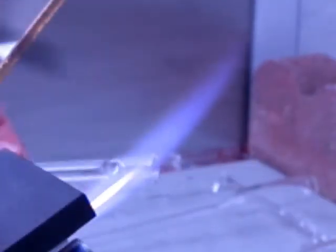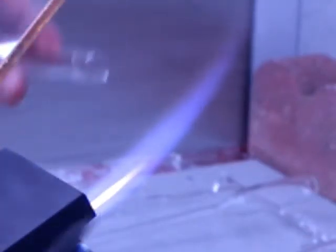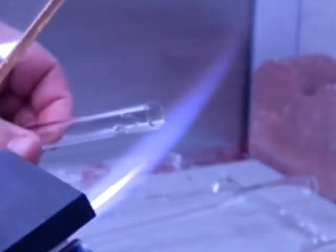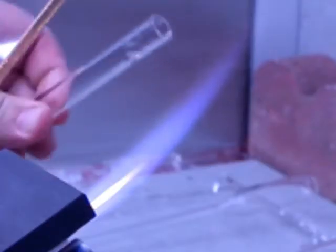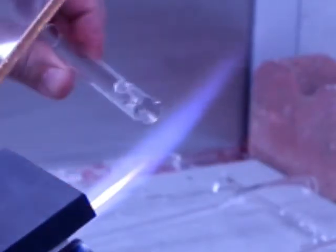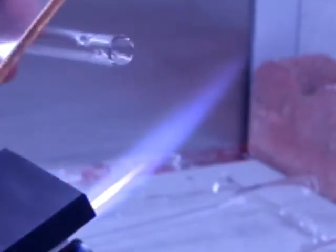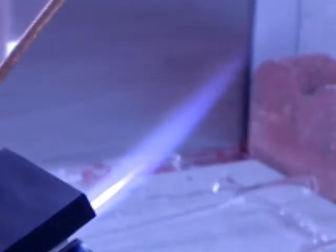Being able to make these type of indentations in the glass is not decorative in scientific glassblowing. These are used in Vigreux columns and in condensers to have a place on the inside to pack in steel wool or other types of media that you might want in your chemical apparatus. For a Vigreux column they give you surface area for condensation. This is actually something I'll probably make a video of later — practicing this technique of making a spot, pushing it down, moving to the next one, pushing it down, and going from there, to really get a feel for how the glass has to be heated to properly move.